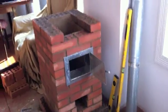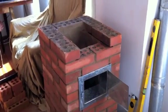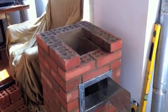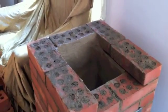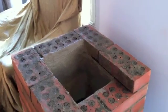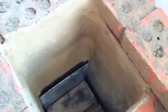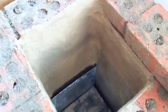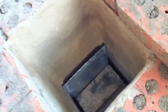Just a little bit of a video I want to share. This is a small heater that I'm building for a friend. We wanted to test a different liner than firebrick — to do what locals do in their stoves and see how it works in the masonry. What I've done here is mixed pure clay with wool, and it makes a plaster that's very nice to work with.